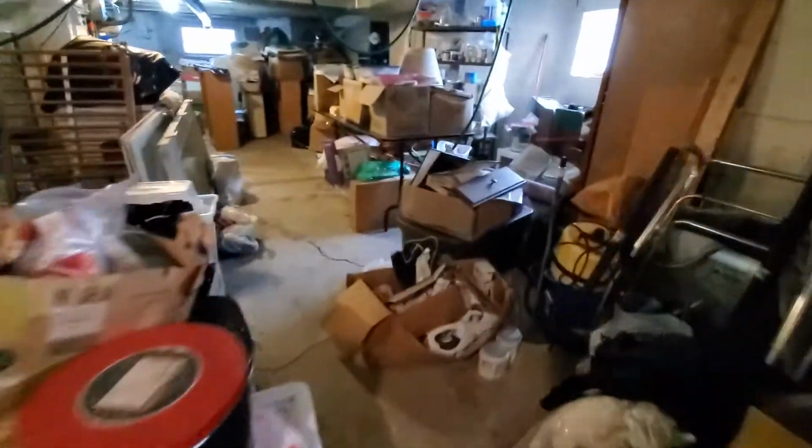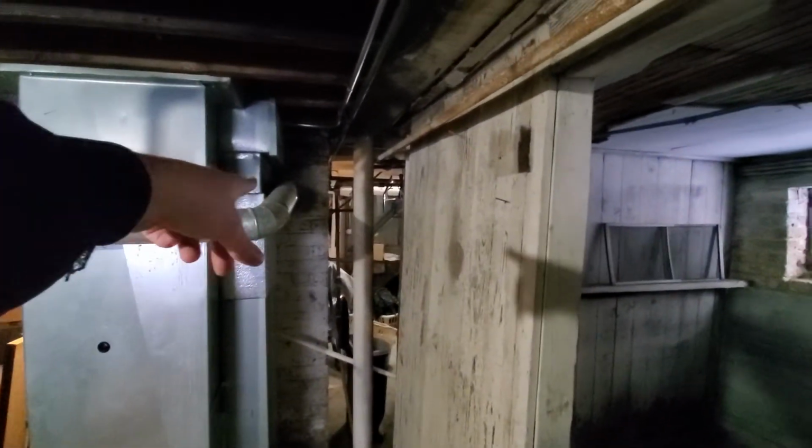All right, last piece of the puzzle is the 90% furnace venting. The plan is, furnace here, we want to take the vent toward that lolly column, through here, along, over here, come across, ahead of the window. Yes, we'll have to pitch it, and yes, the homeowner knows that it's going to be basically right on top of the window right here.